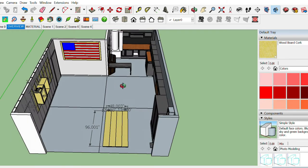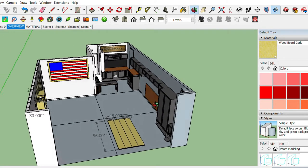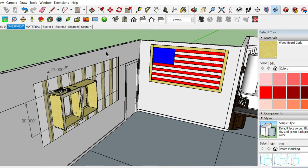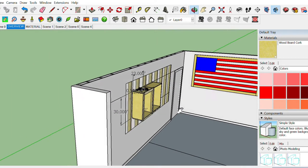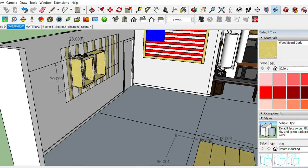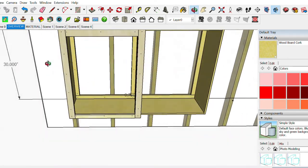We are now in my virtual two-car garage. Everything you see here is what I've already got built. I threw up this wall demo to show the theoreticals of how your walls look. Most houses have a 2x4 frame with a sheet of half-inch drywall over it, and studs are 16 inches apart. For garage cabinets especially, this building method is really, really good because you save a lot of material and cost, and you can still dress it up. I use half-inch particle board because a whole sheet is cheap and you can get a lot out of each sheet.